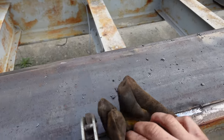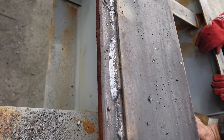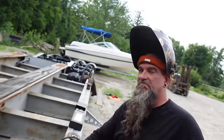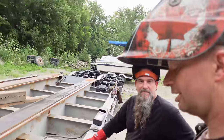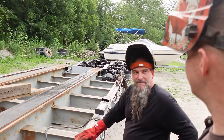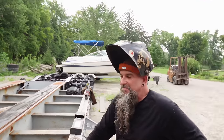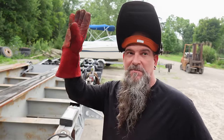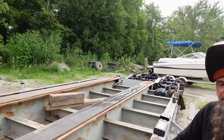Even just this little bit of coaching made a big difference - from that weld to that one. Very nice, that's a really slick weld. It's been about 15 years since I've used stick, not really used it much. In a factory setting they think it's time-consuming, smoky, and spattery with rework. But it's perfect for field work, all-position welding - you can weld upside down, and it's still among the strongest. Majority of all structural work in the field is always done with stick anyway.